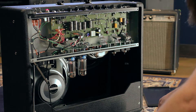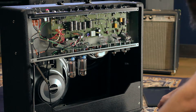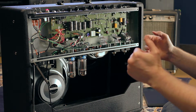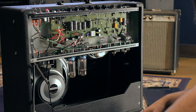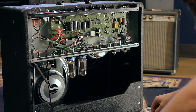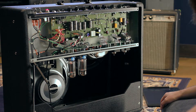The caveat is that certain amps — especially Fender amps — can sound good with a slightly colder bias. It allows them to compress a little more and even out the mid-range with the top and low end. But finding that sweet spot is a matter of adjusting to taste after getting it into an acceptable range. In my opinion, running them at 44 percent doesn't really sound good. Once you get up to 50 or 60 percent, the amp sounds better — I find around 50-some percent is pretty good for these amps.